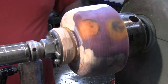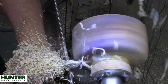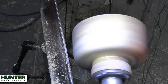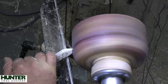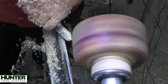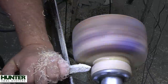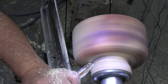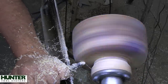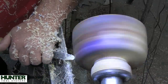If you haven't seen this before, the hot melt glue is melted in an electric frying pan and I dip the waste block in it and stick it on the bottom of the bowl. We're now outboard. If you're wondering why I turn on the outboard end of my lathe, it's because I'm left-handed — I'm turning on a 20-inch General that has left-hand threads on the outboard end, so it is a lot more comfortable for me than working over the lathe bed. That hot melt glue on the base tends to clog up those small cutters, so I like to get rid of that with the gouge and then go back with the carbide tools from Hunter Tool Systems.